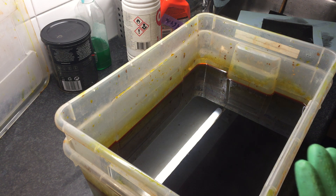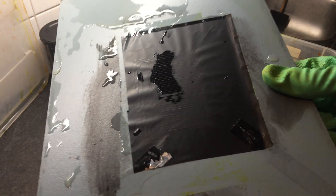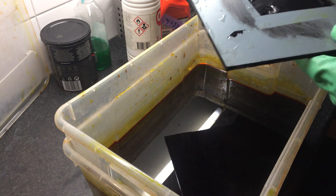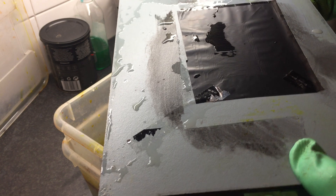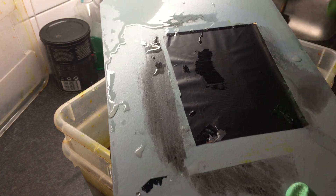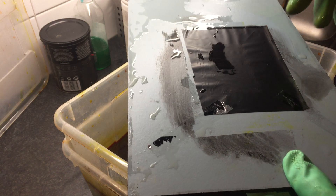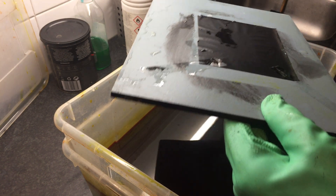I did a lasering again - hardly visible, this tiny bit. I did not clean it off as much. You can see that when it's lasering it heats up the foil at some spaces, which makes it all wrinkly. I might have to speed up or something. In this case I moved the laser three millimeters upwards so the beam is bigger - hopefully less potent.